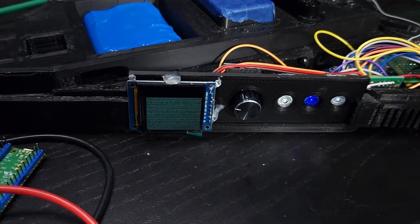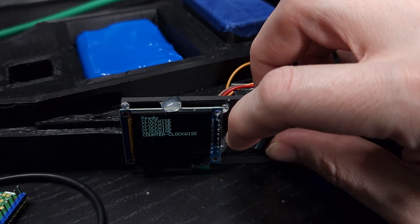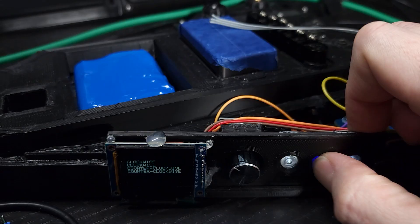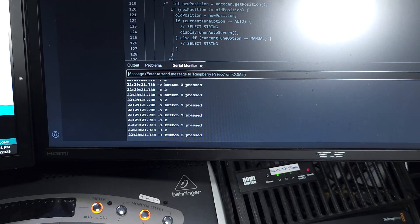The controls work just fine. The screen took me about two days to get working, and even then it was a little iffy. My only theory is that the traces I cut and rerouted were not completely cut. I could isolate the screen on a breadboard and it would work just fine, but when I plugged it into the main board on the guitar it made up its own work schedule. I was just done with it and decided to say screw it — I'm just going to move to the new board. And that right there is why you're just now getting a new video.